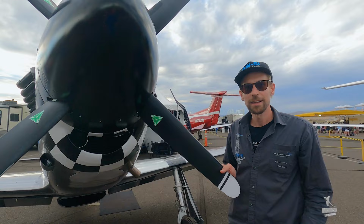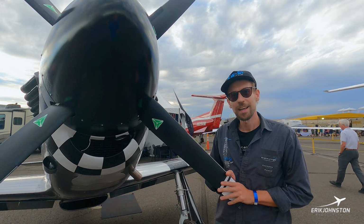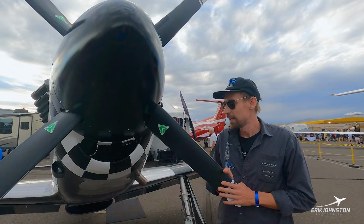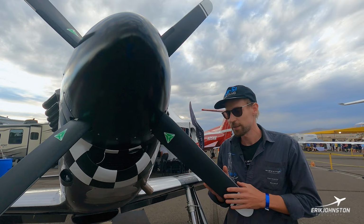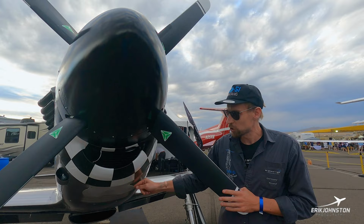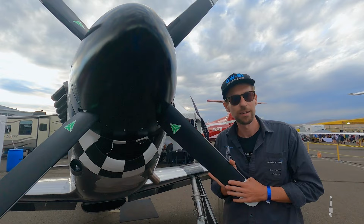And to be 100% safe with the temperatures, because we flew from Florida to Oshkosh to the EAA AirVenture, I wanted to be safe, and so I've installed this little wind deflector, and it worked out pretty well. All the temperatures were in perfect condition, so that was no issue. So we kept it because it's a nice feature, but if it's, let's say, a normal outside air temperature, you can also remove it.